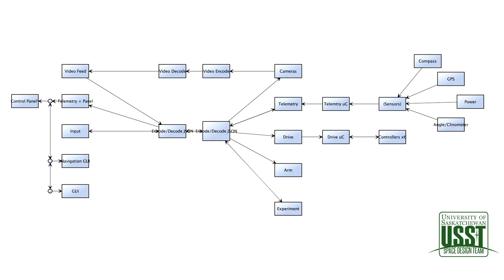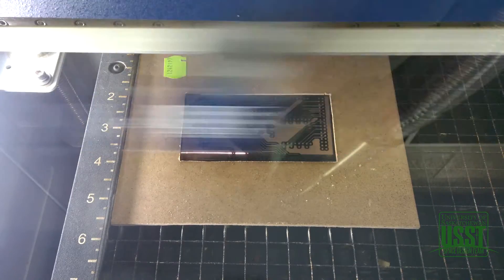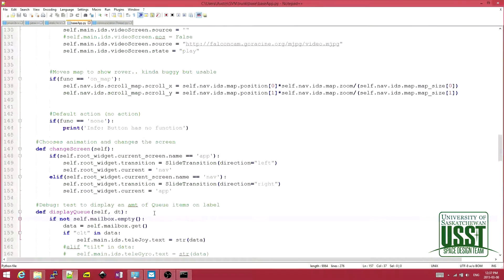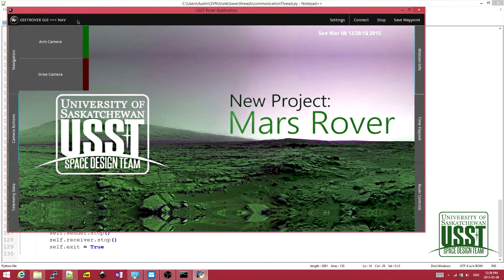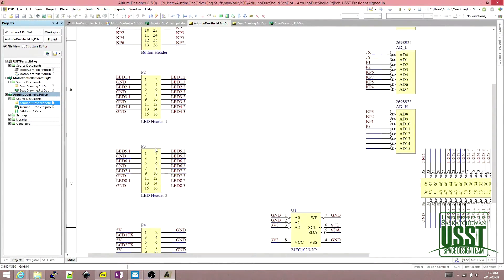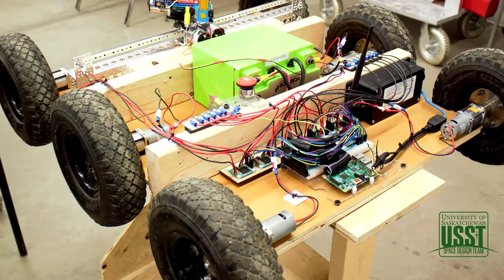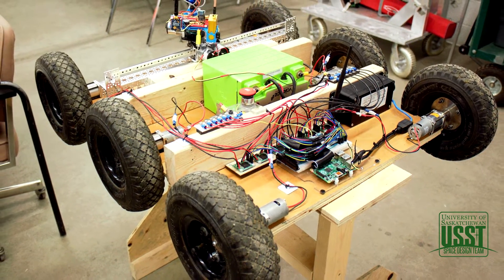With the data we collected last year, we've been able to do a complete redesign of the electrical and software systems. On the electrical side, we've had a lot of fun with the laser cutter, developing a photolithography-type approach to developing custom PCBs and making a more compact and reliable design. The software has received a complete rewrite — we've stuck with Python but moved on to the Kivy library, allowing us to make use of OpenGL graphics as well as much more complicated and beautiful user interface designs. On both the rover and the base station, we've gone with a multi-threaded approach to software, allowing different systems to have different priorities and wait times, enabling smooth and continuous operation of the rover. On the rover itself, we've also distributed the load onto smaller microcontrollers to take care of the wheels, the arms, and the sensors.